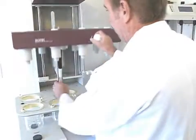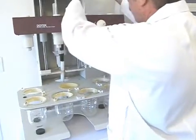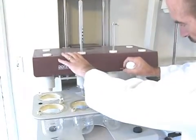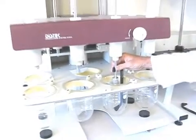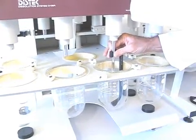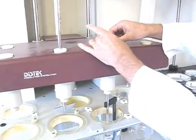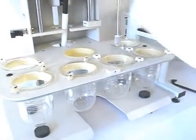Basically with the basket height it's similar. We'll get the paddle up and out of the way, and now we're going to look at the basket shaft. You'll need a three-eighths collar. You start in a high position, and on the Distick we're going to move over to the stop that's specified for baskets. We'll lower the drive head to the stopped position. Again, we'll use the same gauge that sets that height, located on the shaft and down firmly against the bottom sphere of the radius in the vessel, and then we'll start sliding the basket and shaft down until we make contact with the tool. There is that position. Now we're going to go up to the collar and set that collar down onto the spindle top.